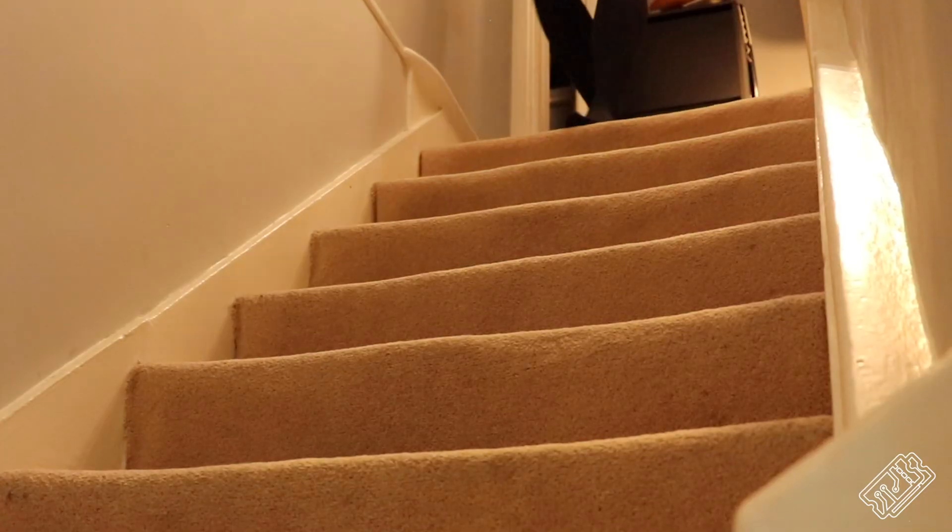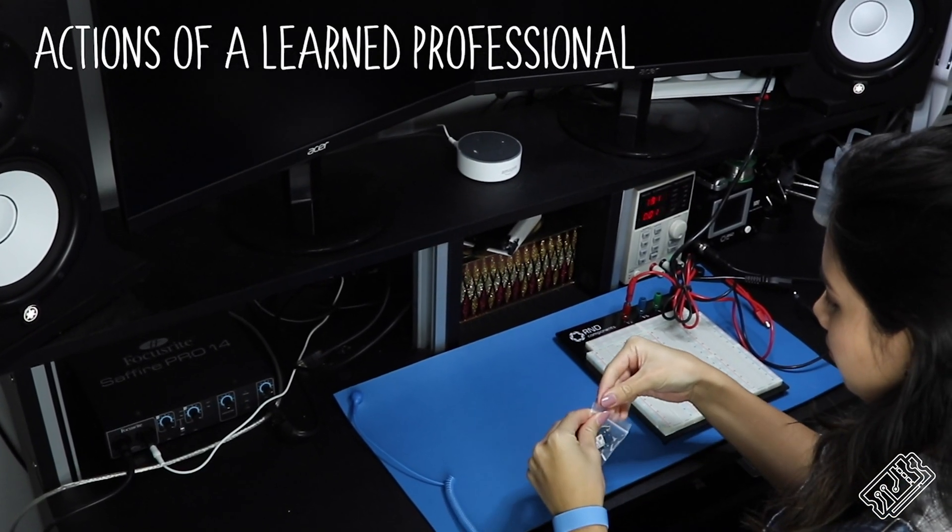If there is one thing that you do for yourself, get yourself an ESD mat for your workbench. They basically drain static charge from anything you put on them. There is nothing more heartbreaking than destroying a new component you've just bought because you were rubbing your feet on the carpet. We also have this lovely moveable magnifying glass lamp. This isn't a necessity for all labs, but a good side light is a must-have for us — it's great when you're leaning over the table and the ceiling light casts the shadow of your head on what you're trying to do.